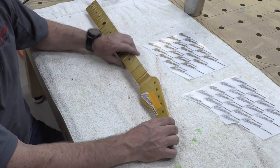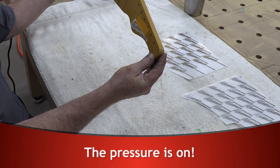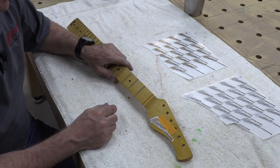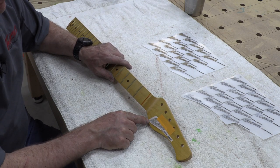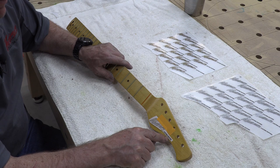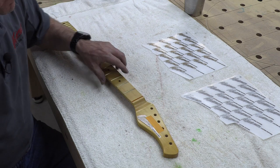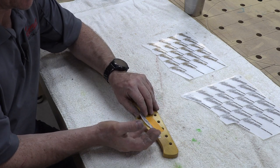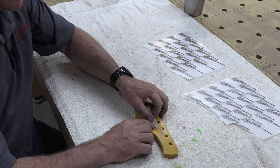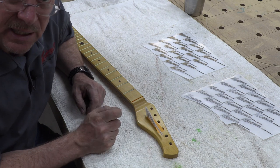I'll try to zoom in a little closer in post-production. Basically, I've already laid the logo on the headstock where I want it — this is the last chance to figure out if it's straight, and it looks good to my eye. You could draw lines to make sure they're perfectly straight, but I kind of eyeball it. I know that the beginning of my M is 2 or 3 millimeters from the edge, and 'custom guitars' is about 2 or 3 millimeters from the highest point there. So if I line it up generally in that place, I'm pretty straight. Because the protective layer is on the back, we can lay this down wherever we need it to be, then place a piece of tape on top. Now we can heat this area up — remember, it's a heat-activated adhesive.